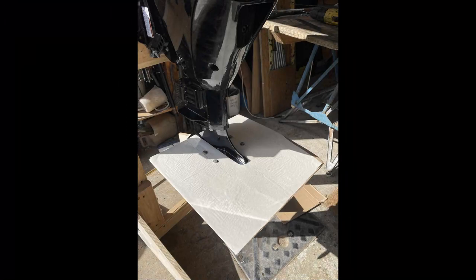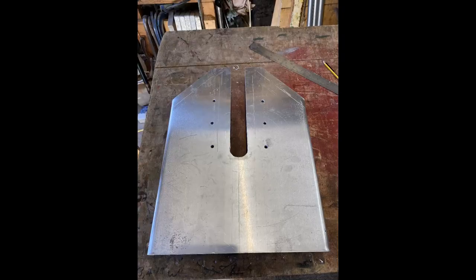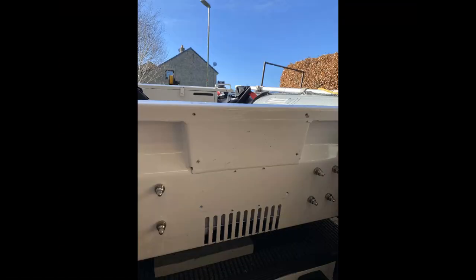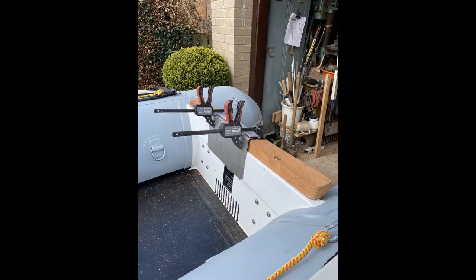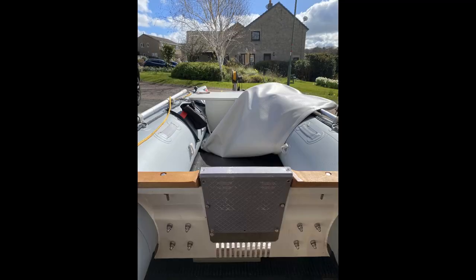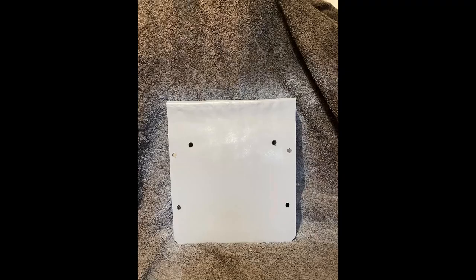For the perma-trim, we made a cardboard template. When we got it right in the shape we wanted, we transferred it onto the aluminium plate, then cut, drilled and shaped it. I then roughed the surface up and added three coats of metal primer, then three coats of black top coat. Next, we removed the plastic transom pads by drilling the rivets out. We got the stainless plate and mahogany into position over the transom, shaped it round, flattened the edges with a router and sander for the Scotty mounts, and got the plate to the right angle. After placing the bolts through and measuring them, we cut them away from the boat, then sprayed up the stainless plate before reassembling the whole thing.